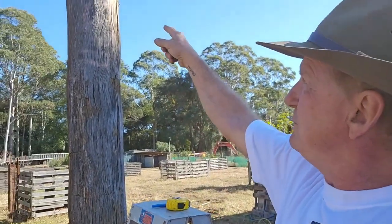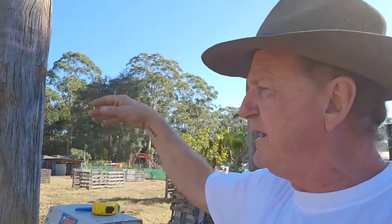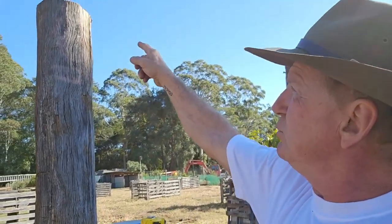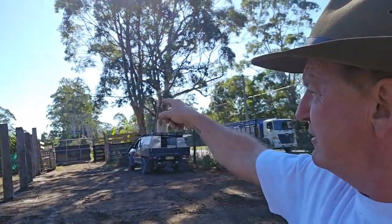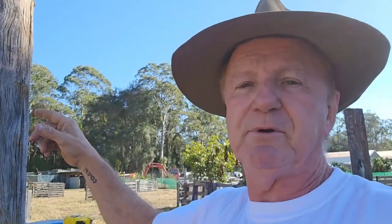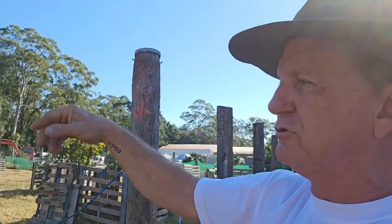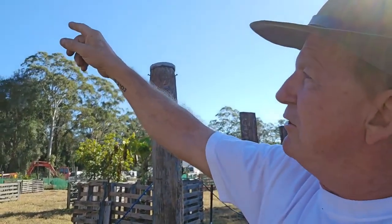You work out where you want to be at the very top because you put the top wire first - it means you don't tangle your wires, believe me. So you put a wire at the top, put one at the very end, and when you do the strain don't go over tight because you'll use little ratchets. If you do it over tight you'll pull your poles a bit. If you only go 800-900 in the ground you can have a little problem, so just do it just tight enough after the concrete's gone hard.